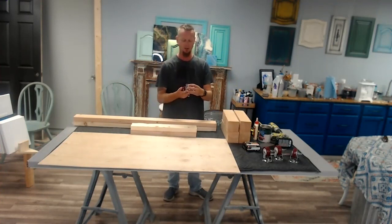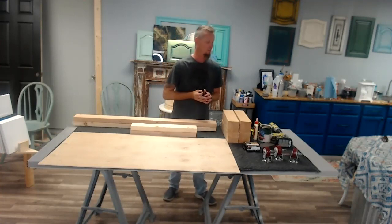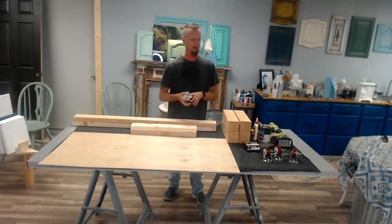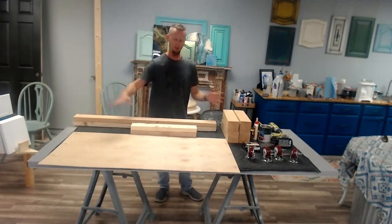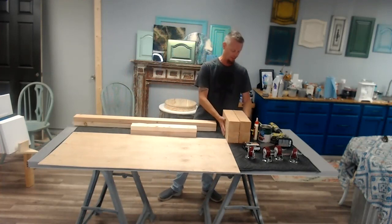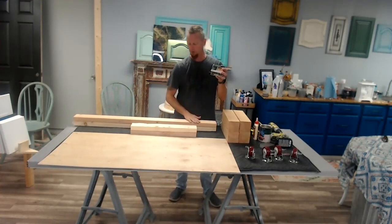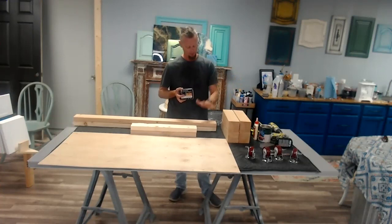This is a 3-inch polyurethane swivel caster, also locking. So once it's in the paint booth, you can lock those casters in and the cart will not move. But typically, with this smaller cart, you're probably never going to lock it while you're in the booth because you're going to want to move it around. And you got those at Harbor Freight, right? Harbor Freight. Love Harbor Freight. 3-inch screws. We're going to use 3-inch screws to tie the frame together and tie the legs to the frame.